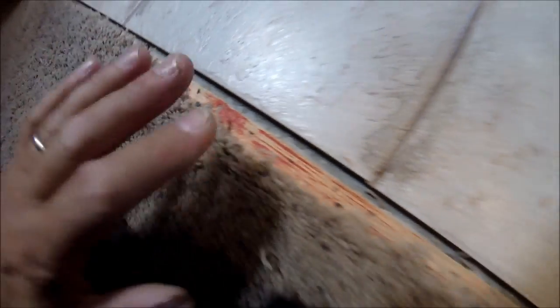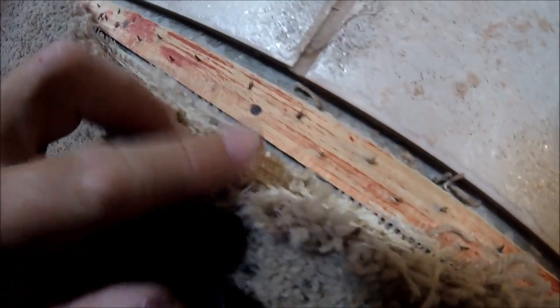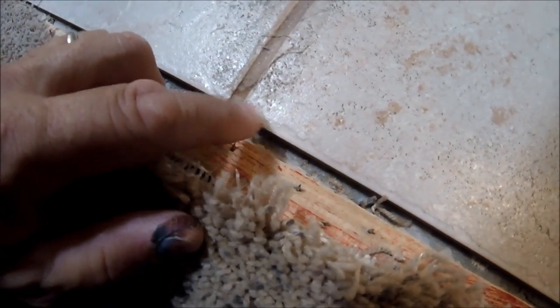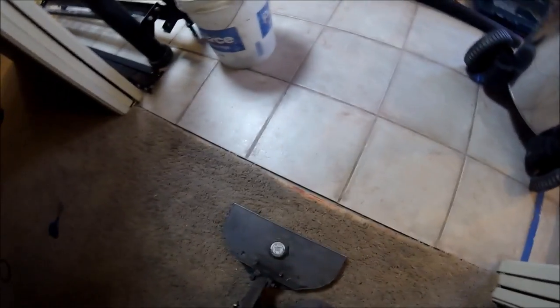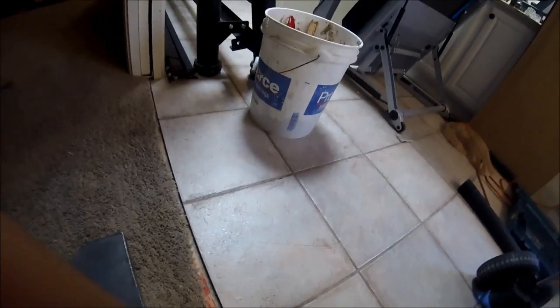I've tucked it out and everything like that. Since the center is the worst of it — you can see the backing there — even if you stick that up on them tack strips, it's just not going to hold. The center is the furthest part that needs stretch, so I'm going to want to start right there first, and then I'll just work my way around down. I'll set the camera down and you can see exactly what I'm going to do.